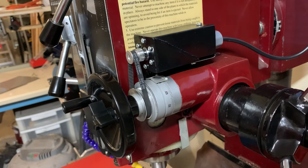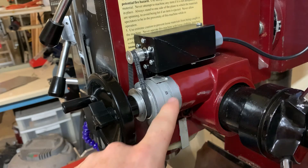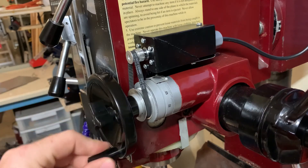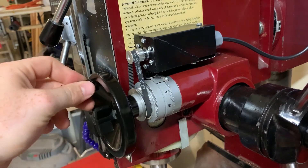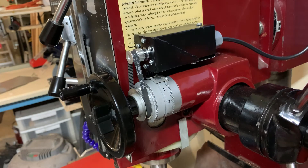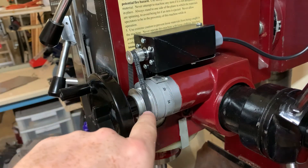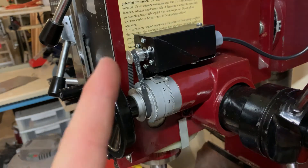The lower timing gear was bored on the lathe to a press fit, and that was just pushed onto the existing snout on this graduated ring. Normally, without the system in place and without the clutch engaged, the hand wheel is just turning the mechanism and moving the quill up and down. You can set the graduation here, and normally you would just spin the hand wheel and this would move along with it. What I've done is I've decoupled this from the hand wheel by taking the set screw out, and I've replaced it with a clutch mechanism that I'll show some more pictures of in an image I'll insert next.